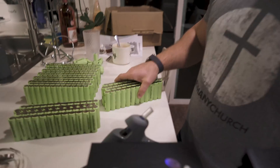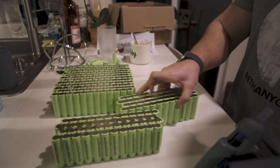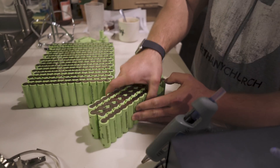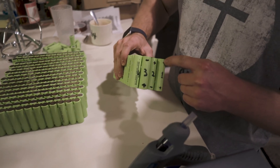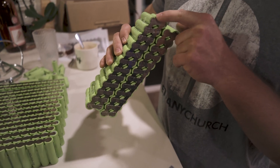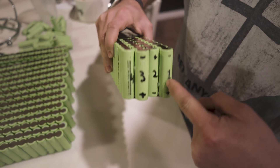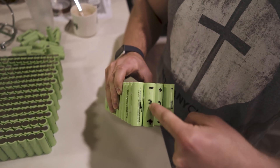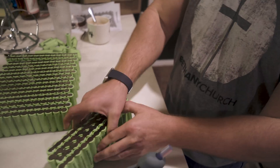We went ahead and got all the series connections done on one side, so all these batteries are connected on that side. We're starting off doing the series connections on the top part now, gluing them in four parallel groups. This is the first set done with the full series connections made. Power is going to flow through — you always start with the one negative, and then your last one has the positive lead exposed. You connect the battery here and the voltage adds up as it flows through, then connects on the bottom to the next negative, comes back up, connects on top, and flows down.